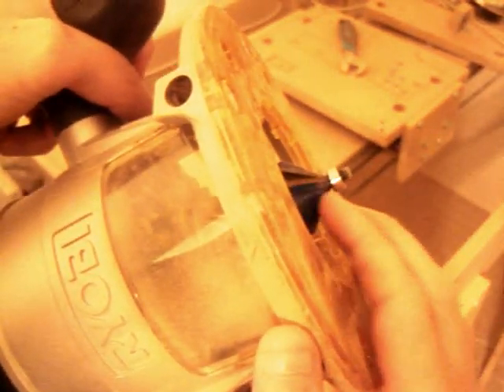To hold the aluminum angle in place, we will bevel the edge of our rail support. A chamfer bit is used for this purpose at a 45-degree angle. The depth of the cut will be less than half of the thickness of the board, to leave some stock to guide the bearing on the bit.